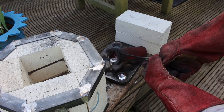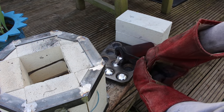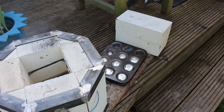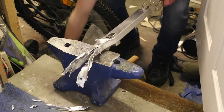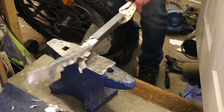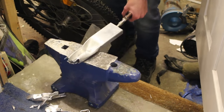Here I'm casting a couple of ingots by pouring molten aluminium into an old baking tray. I only use scrap for melting — all of these ingots are completely recycled and obtained for free. The scrap I'm using at the moment is sections of old aluminium ladder that was unsafe and thrown away. To break them into small enough pieces to fit in the crucible I'm just whacking them with a hammer on my anvil — it might not be the quickest way but it was quite satisfying.